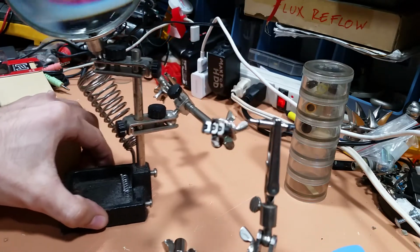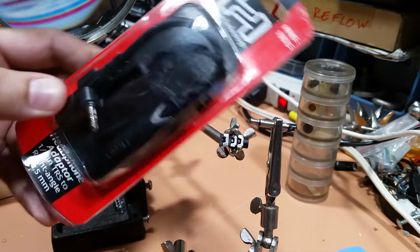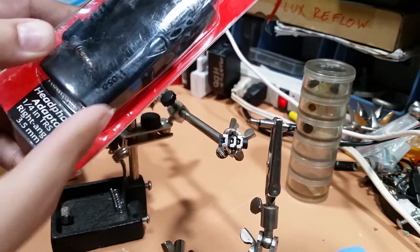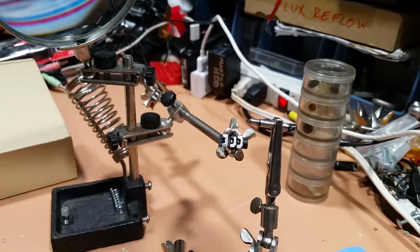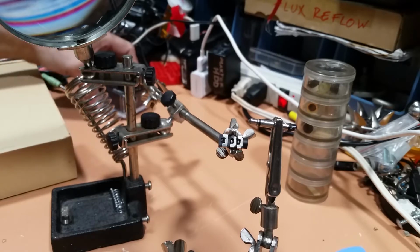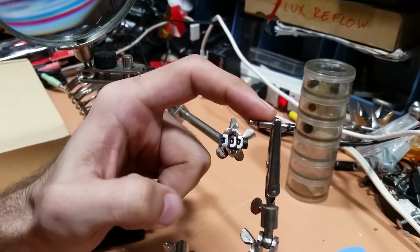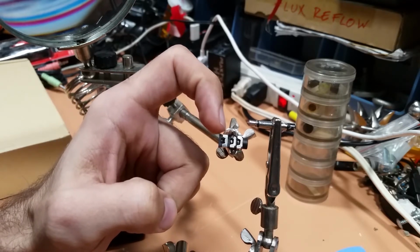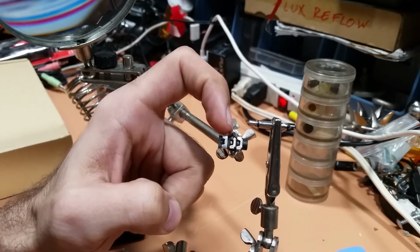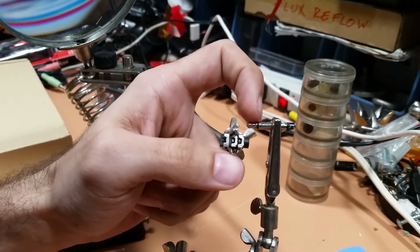Okay, so when I got the new wireless mic, I was wondering why, when I plugged in this huge 90-degree angle adapter, which goes to the quarter-inch TRS, I was getting no audio on my Akaso. It was like something was shorting out the mic. But then I realized, which I'll show you in a moment when we dig into the wireless mic, it was a mono headphone jack. And then I realized when I was modding the headphone jack, I soldered this tip and this ring together. So I basically just shorted the tip and the ring internally inside my Akaso.